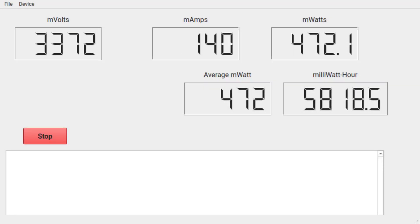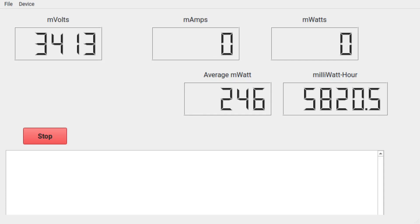Here is the old controller sitting idle in Borderlands 3, not on any menus — just idle in the game. It's very consistent, running right around 470 milliwatts. And here it is getting ready to shut down. Some 3.371 volt readings pop up, and there it goes — just a tiny bit under 3.4 volts.